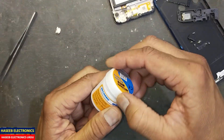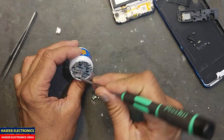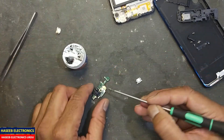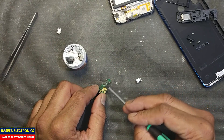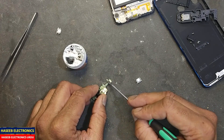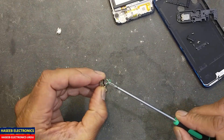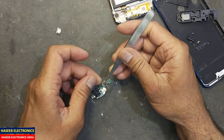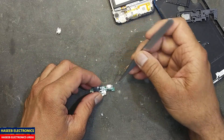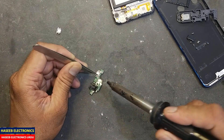Apply a very little amount of liquid solder. I am using a mechanic solder paste — it consists of tin 63% and lead 37%. Apply a very soft, thin layer to the base as well. Place it here and hold it in position.